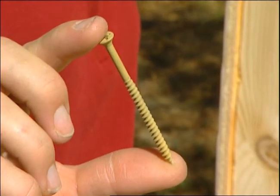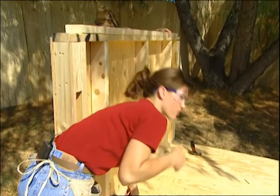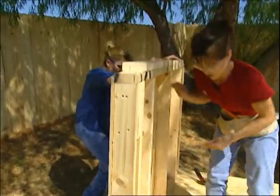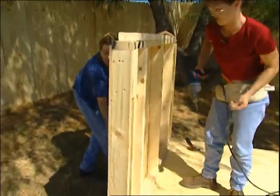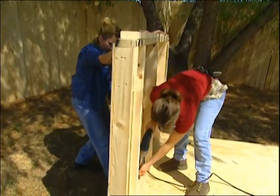I'm using a three-inch wood screw, and I'm going to drill this in towards the back so that it'll go through the wood into the joist. If you have two people, you can hold onto this and kick it with your foot so that the siding is also flush with the edge — that way it'll attach properly to the foundation.